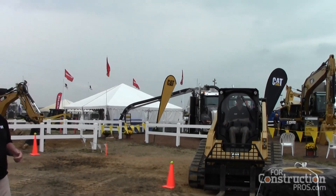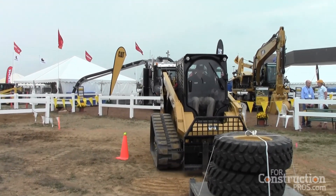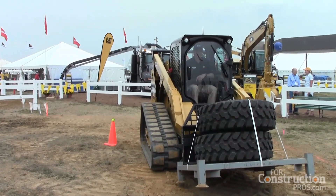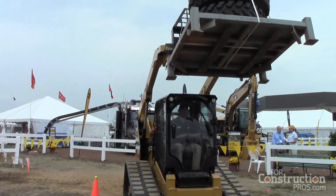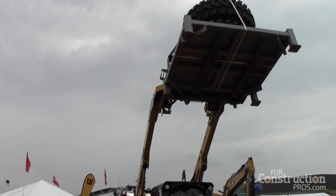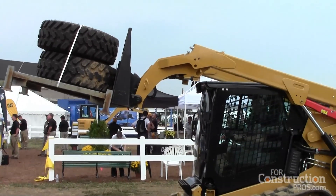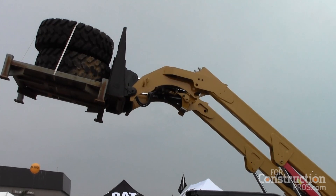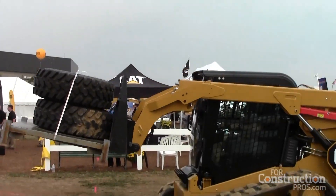Jeff's going to pick up the pallet of tires here. He's going to pretend like he's going to load it onto a shelf, maybe onto a rack. The load will stay level as it raises — nice and level, put it on the shelf, everything's good. What if he was pulling that off the shelf? Say it was sitting on a high rack and you need to pull it down and put those tires on the machine. He tilts it back a little bit to get it in a safe position, now he wants to lower it to the ground. It'll maintain that angle all the way to the ground with only a lower command — no manual correction needed. Just lower it to the ground and it maintains it all the way down. Nice and smooth.